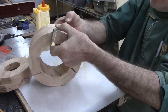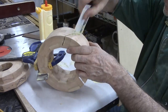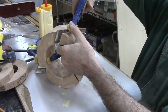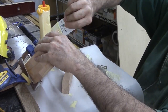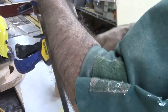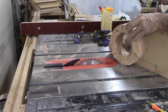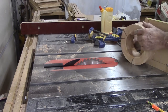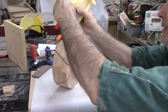After the glue dries, I trimmed back the excess wood. Then back to the table saw to cut the next set of kerfs with the opposite angle. This is the same process as the first set — I decided to be conservative in the positioning. Then I glue in the final set of walnut strips.